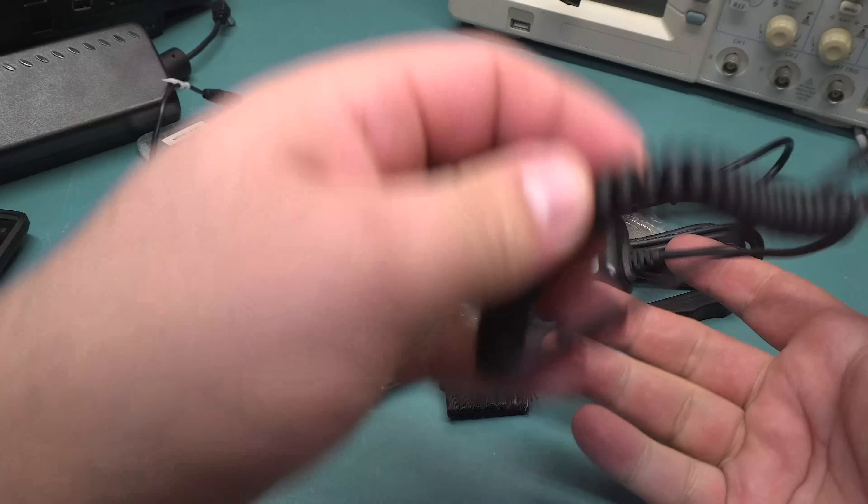Opening it up: it looks like there are more screws behind the battery module. It uses an old-school staggered ribbon connector — an IDC connector. Everything's on the back. This just looks like an Ethernet controller from SMSC, and there's a whole bunch of passives. There's the big SIM reader for the full-size one on the back, and the IRDA sensors. There's a connector that links this board with another one, which is why it's kind of difficult to get out — those are just ribbon connectors.